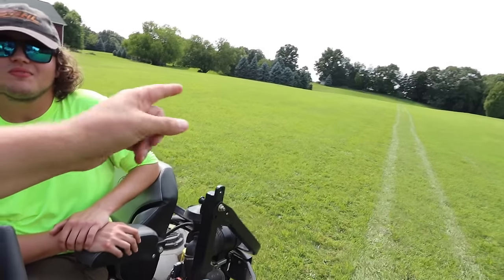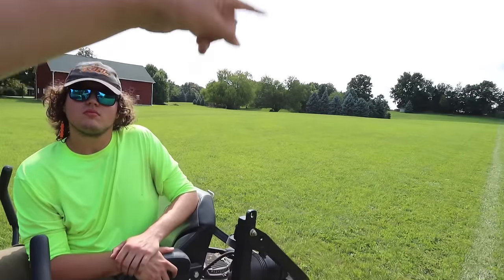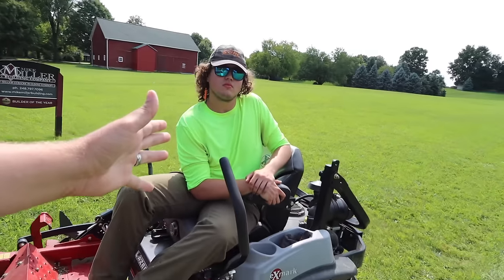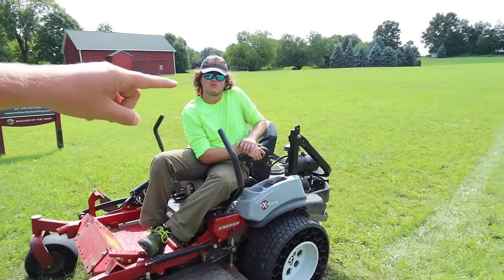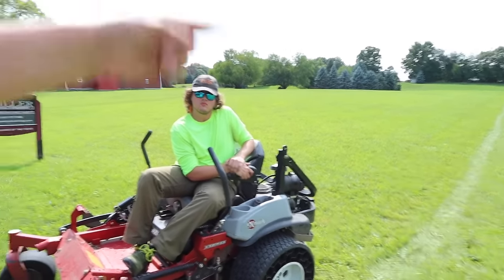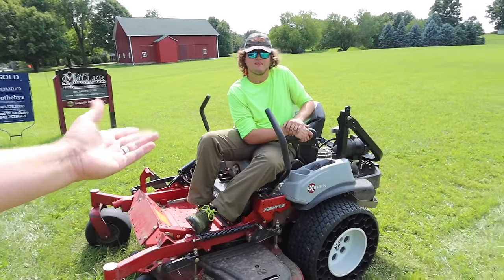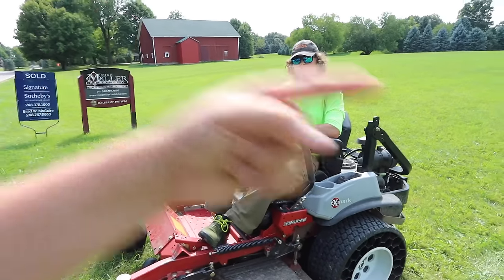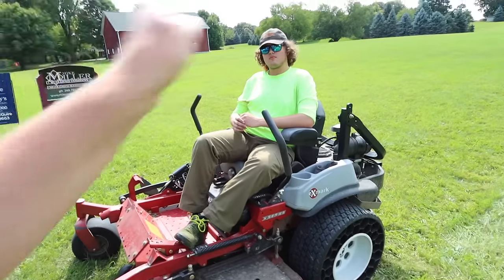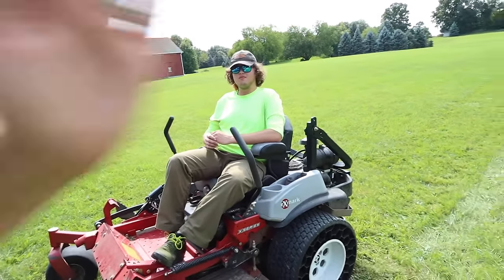All right, so here's what we're gonna do. I'm gonna do this side, you're gonna do this side, up, down. So anytime we come to a property, there's three parts of a zero turn. We gotta do the outline, we got to master painting the stripes, and the third thing, master the turns. That's all it is to a zero turn. The outline, always shooting away from the home. And then once we go to the inside of the home, shooting into the middle, we do the outline going around the outside, shooting back in. Then it's just painting stripes.